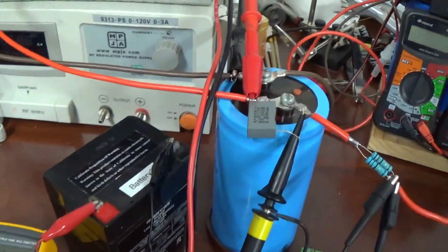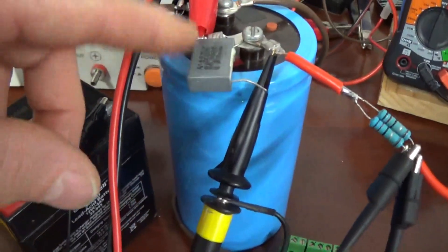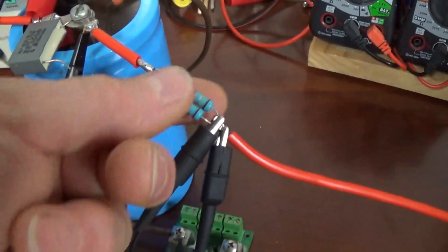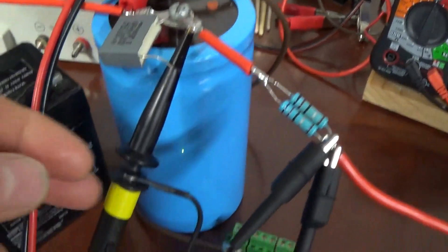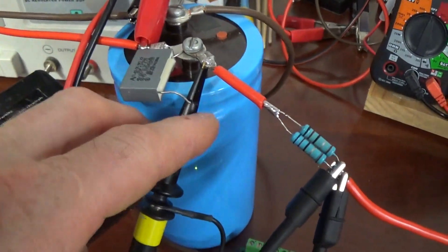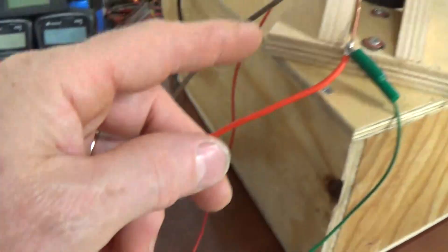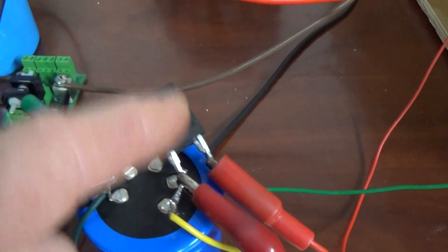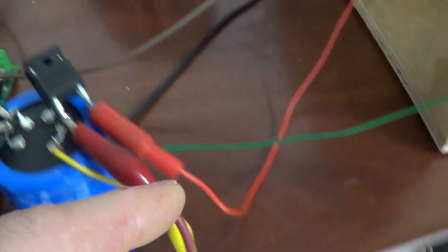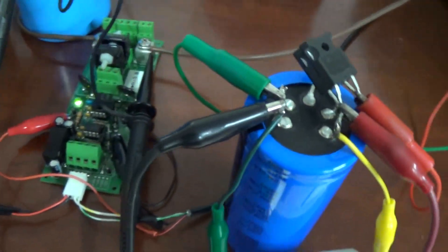I've got it at about its point there. That's my tank circuit here for the input, and that's 100,000 microfarad. I've changed my current sensing resistor as per Verpi's instructions, and that is now the current probe right here, with my two grounds here. I've also flipped around my flyback diode - it's now coming out to the positive side instead of being on the negative side of the capacitor.